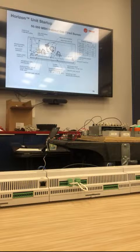A big issue with that statement of 2 to 3 degrees is where it becomes a problem. If I have a 2,500 CFM unit with a 300,000 BTU burner, that's a 100-degree rise, which is our max. The max temperature rise we can have on our unit is 100 degrees. Well, we have a 10-to-1 turndown burner, which means the minimum rise is 10 degrees.